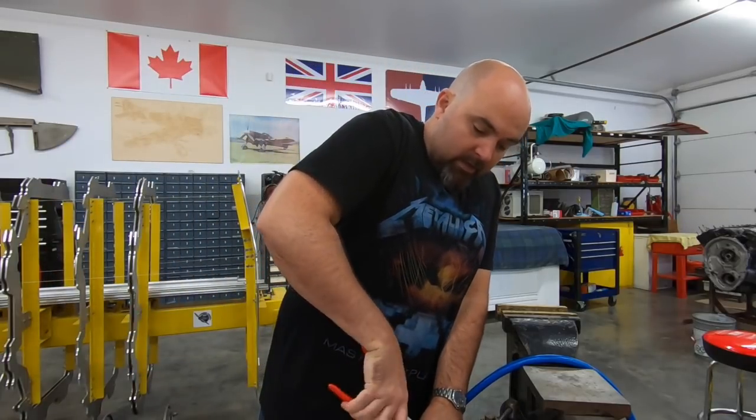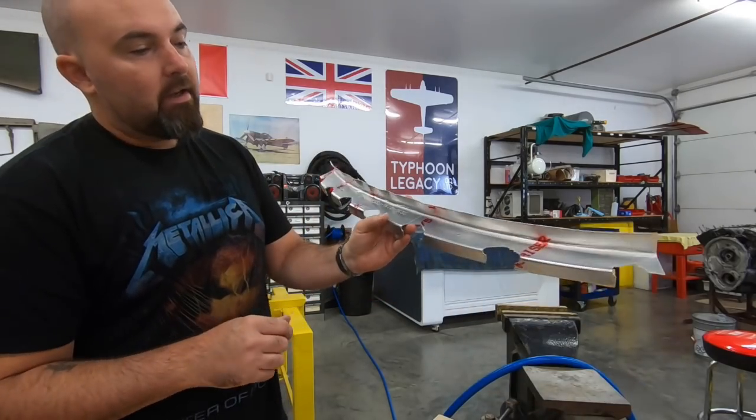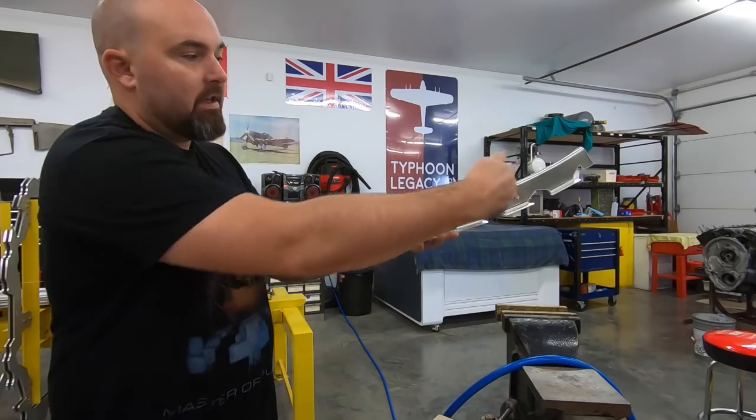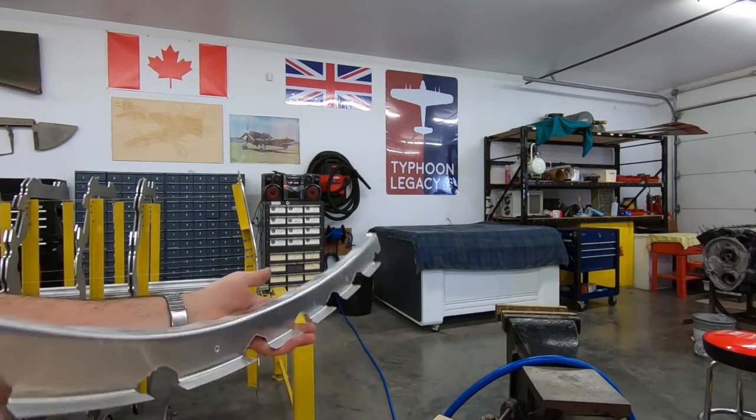Just like shrinking, there's always adverse effects — and it's only an adverse effect if you haven't really completed the movement, whether it be shrink or stretch. You're going to have a flange take an awkward shape if the shrinking or stretching isn't complete. By completing the amount of shrink for the angle on the last flange, it took care of any work on the web. Now in its early state for our stretch flange, you'll notice that it also changes the angle of the web.